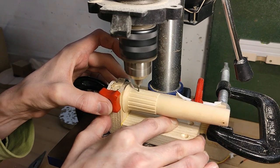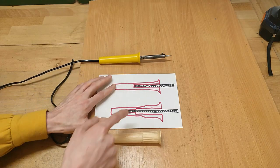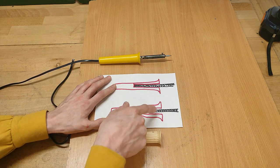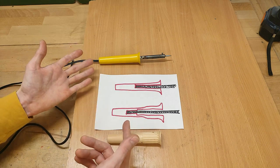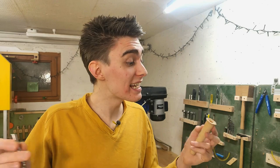On the new design I also added grooves to provide more grip, because I ultimately ended up not liking the pudgy ball roundness of the old one. But the real difference between the two is the size of the hole. On the old one the metal tube was basically just shoved directly into a hole in the wood, whereas on the new one there's a bigger diameter hole going quite a way in, so the tube really only touches the wood back where it's almost cold anyway, being mostly held in place by the washer in the front. That way I get an air gap between the metal and the wood, which should hopefully do the trick in terms of insulating.